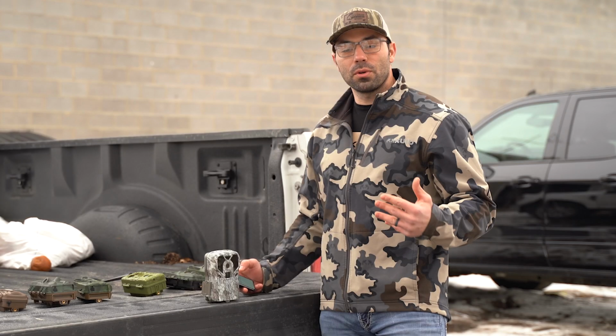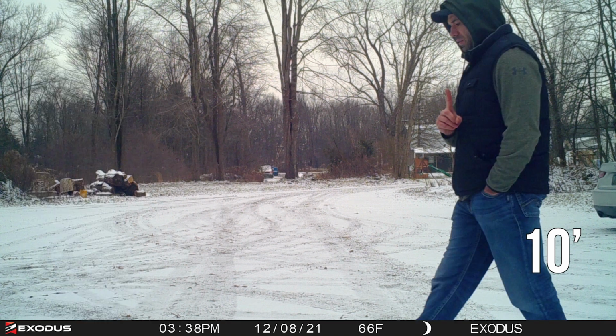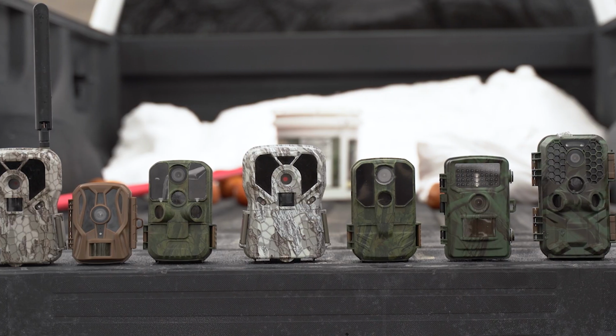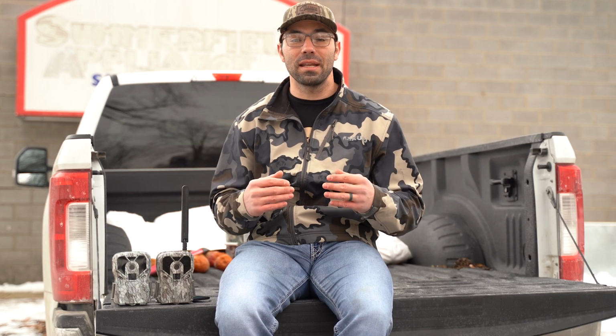When you get back to your computer, you should have 2 photos at every distance, one coming from the left into the detection area and then one coming in from the right. The idea here is this test is very easily repeatable with any type of camera, and it gives you a really solid understanding of if and where a camera's performance is lacking.